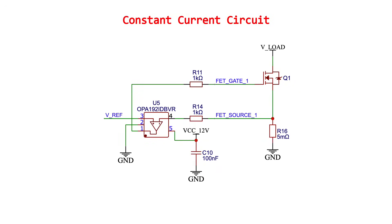To overcome this, I designed this circuit which uses an op-amp to read the voltage across a current shunt and compare it against a fixed reference voltage. It will automatically adjust the voltage of the gate pin such that the voltage across the shunt resistor matches the reference voltage. Essentially, it's a constant current source. So then I took this circuit and multiplied it by 4 so that it can handle more power, and added a bunch of other complicated stuff.